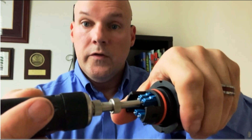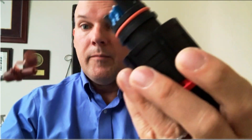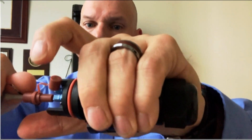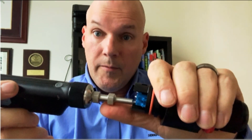It's a very simple process, just like checking any other 1.25 — come in, use the tip, align it on like so, and then press the button and do your inspection. To clean the IP25, it's a little different than the standard IPLC just because of the housing. We're going to use the end cap that comes with the Smart Cleaner. Take the Smart Cleaner, flip the lid open, align the tip onto the barrel, and give it a quick push. Now it's clean — come back in, check the end face, and you're all set and ready to go.